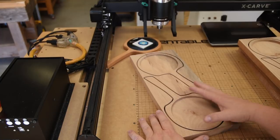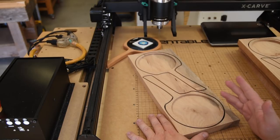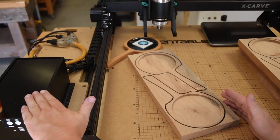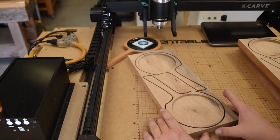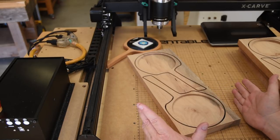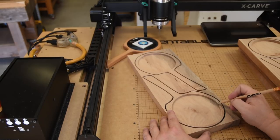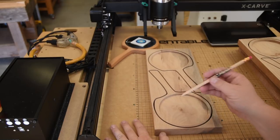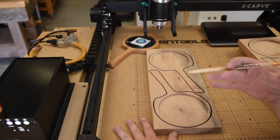Now, this is the first one I cut out, and I had a very typical problem I was having with the old X-Carve in that power, because of a tropical storm that's in the area, cut off to my shop. And I was running it off a laptop, so the laptop didn't power down, but the X controller did, which made the Easel software think that the job was canceled or something, so it stopped and asked me how the finished product turned out. Now, I couldn't restart it at that same spot because the Easel thought it was done. So I did try to restart it at the beginning because it had just stopped when I had started the program. And then you can see that there, I now have this little lip right here because I couldn't get it exactly to the same point. And the return to your original point function in Easel didn't work the way you would think. It's just something different.